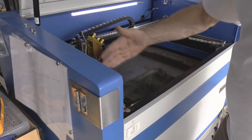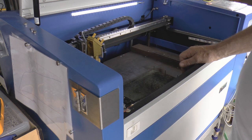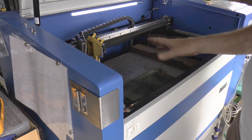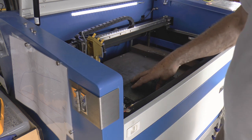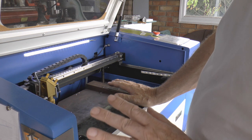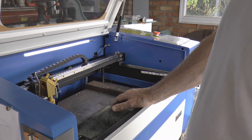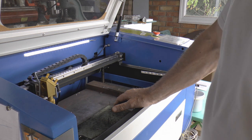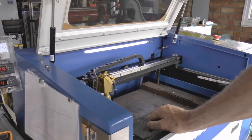With this machine we've got 500mm/s in the X axis and 400mm/s in the Y axis, and even running at four or five hundred millimeters per second on scanning I get very little overshoot. It's a really tight little machine. With a small extension I can put 60 watts into this machine and it becomes an absolute dream. I bought my power supply direct from China - just over £200 for the power supply and tube - but it also cost just over £200 to get it here via DHL. It arrived in four days, but it doubled the price.